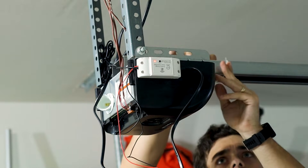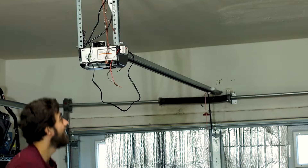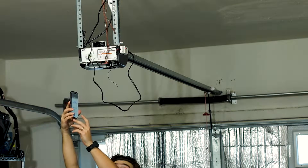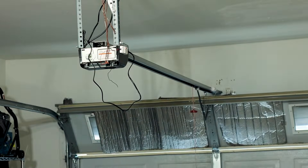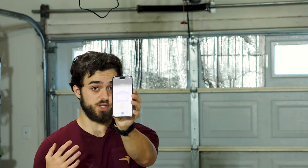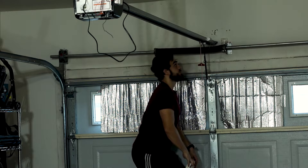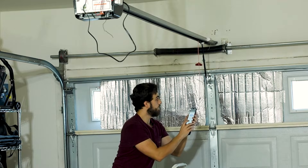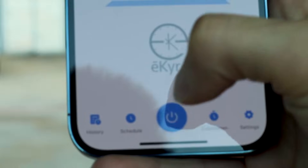Let's see if it works and it doesn't interfere with anything. It's definitely clicking, but it's not opening. The red wire came out from the tugging I just did. Let's try that again. It worked with no interference, but now it's saying the garage door is open — it's not open. That has to mean the sensor is not connecting properly. The sensor is just a bit too far.